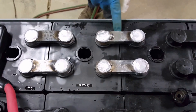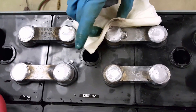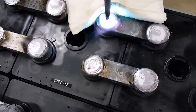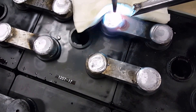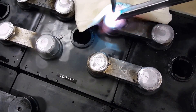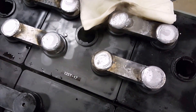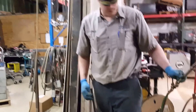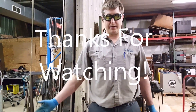So that melted down a little bit right there, so what you want to do is make a mold out of your paper towel. I'm going to start off right here in the middle, heat that up, going to kind of let some of this lead sort of fall down in there, and I'm going to kind of make a pass on top. That is how you reuse old intercell connectors to be able to put a new cell back in a battery.